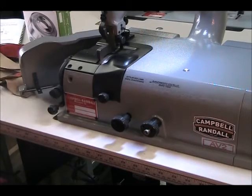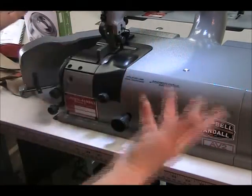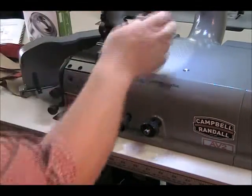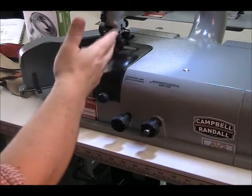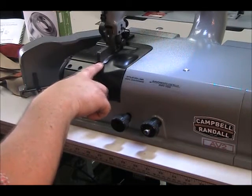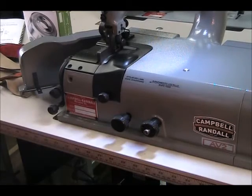So start off with a sharp knife. This is the most important part. If you don't have a sharp knife, it's not going to cut. So you've got to know how to sharpen the blade properly. Let's crank it up. We're going to make some noise. Now the blade, as you sharpen, maintain the gap as it indicates in the book. So I'm going to keep it about a business card right there. And that will maintain, for soft leather goods, a nice cut. When I'm sharpening, I'm going to engage the stone, and I'm going to back it off when I'm done.